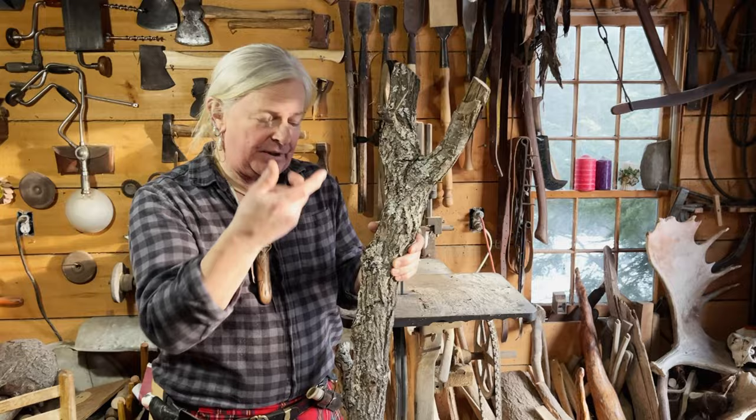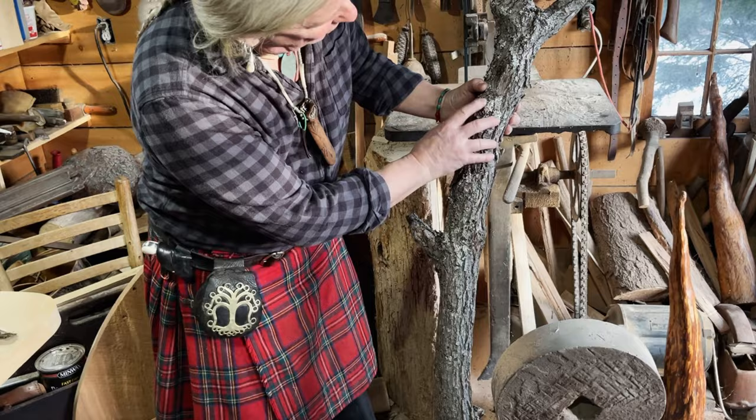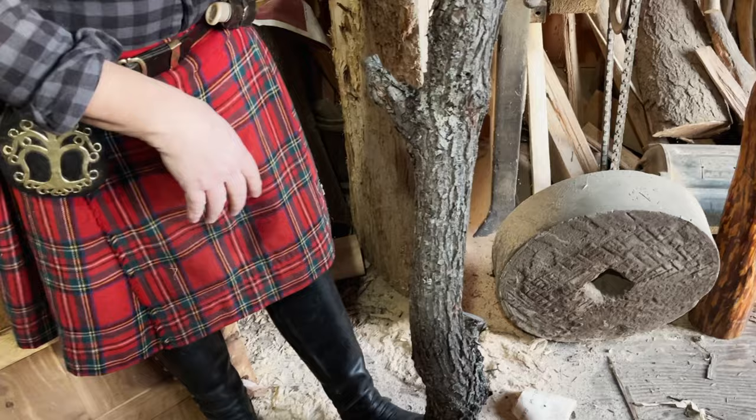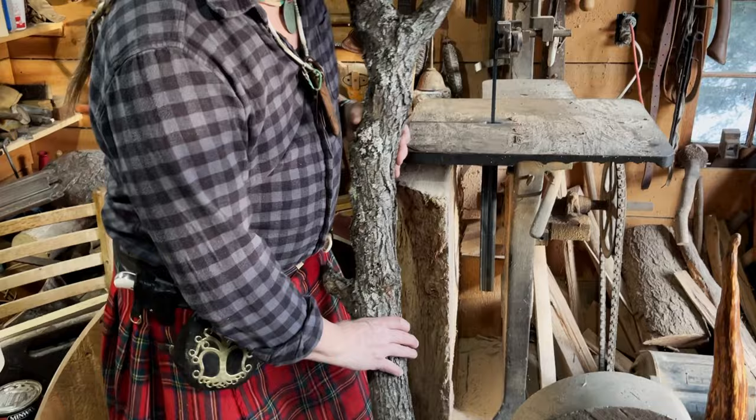So I'm going to basically waste away some of this material and get down below this. You can see the wood — this is all rough, a lot of old limb activity here. These are called cat faces, and it just shows that there was a lot of limb activity when it was younger. It probably would be junk to try to work with. But from here down, it's very clean to about here, so I'm going to cut it below this notched crotch and see what we can come up with.